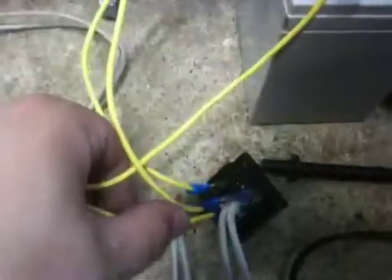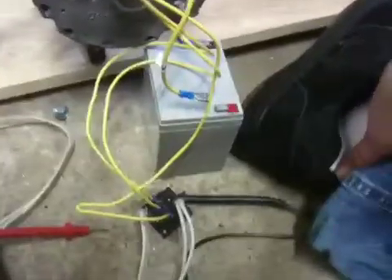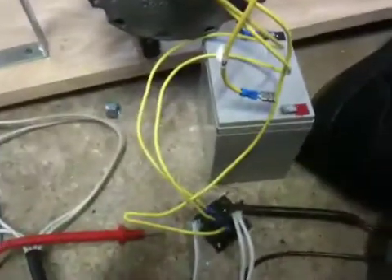I'm having trouble with one of the legs — this leg that I marked by folding the wire of the three-phase is only about half the voltage of the other two legs, so I've got to take it back apart and see what's going on. I think that's what's limiting the output to 160 watts, because it's only running on two phases. I'll check that out and post another update. Thanks for watching.